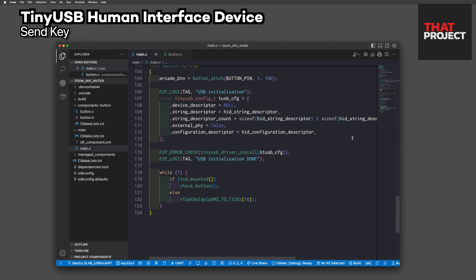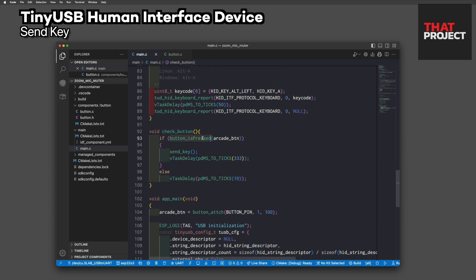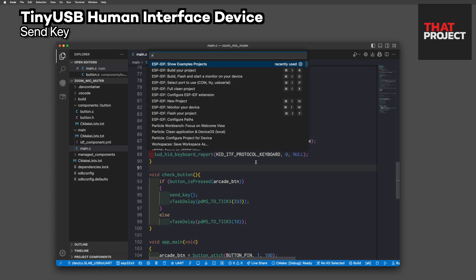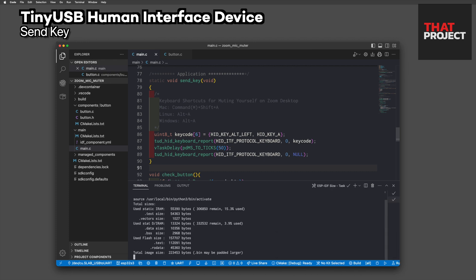Here is the starting point. First, it's adding an interrupt for the hardware button. After that, initialize TinyUSB. My code is also very simple — since everything related to the USB connection is handled by TinyUSB, all I need to do is check when a button is pressed and report a specific key to the connected host. If the button is pressed, it reports the Alt key and A key. After 50ms, it reports back that all keys have been released. To reduce debouncing on the button, I set the button's filter time to 100ms, and also made the button pressable only 3 times per second. I also didn't forget the 10K ohm resistor.